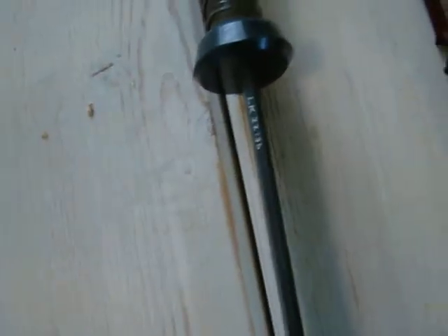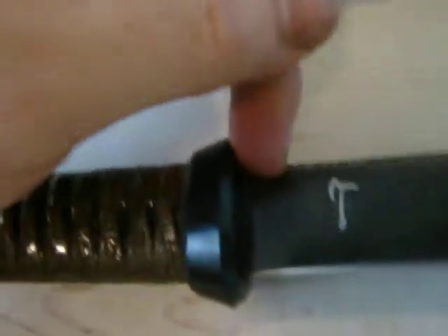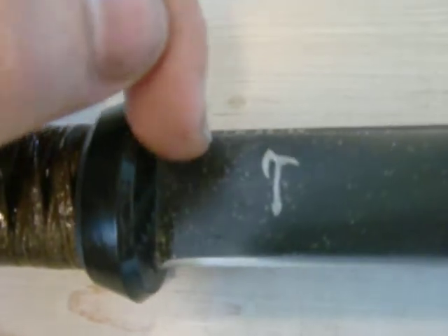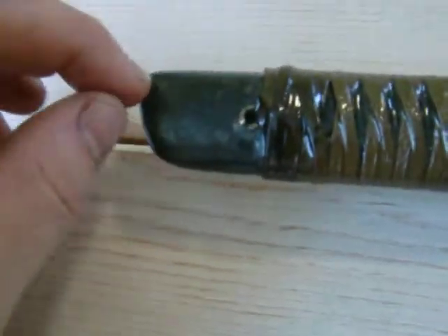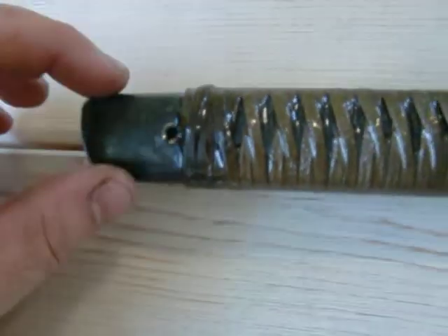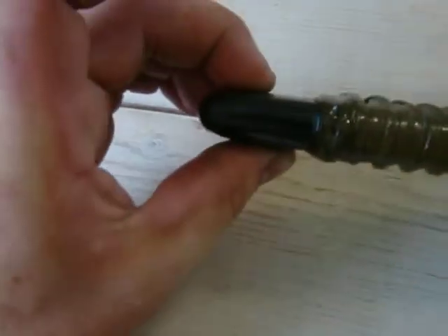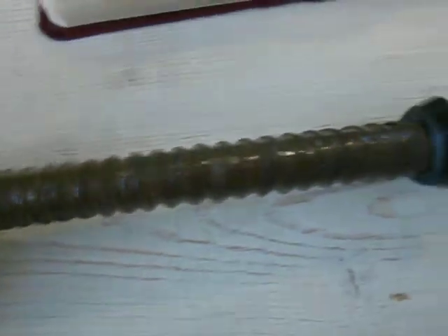That drops all the way back. It's kind of a bit different handle design. From here, it insets about an eighth of an inch and it's full tang all the way back to the last quarter inch of this piece here. The inside of the handle was laminated together to fit the whole tang in there. So it's basically a full tang — it's just reduced slightly so that it fits inside so you don't see the tang through the handle.